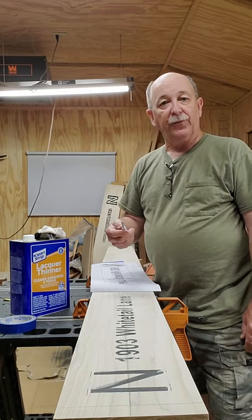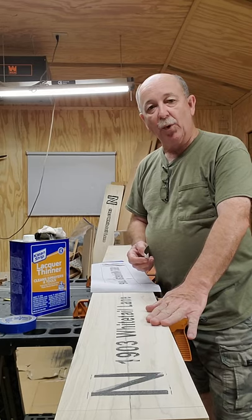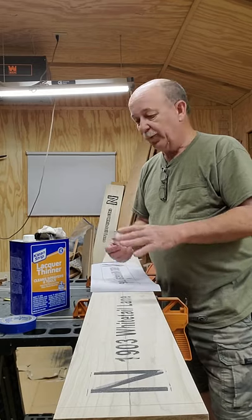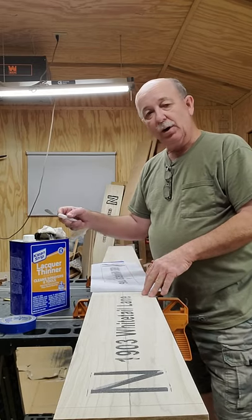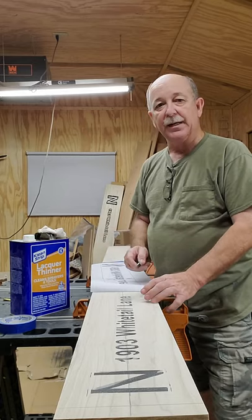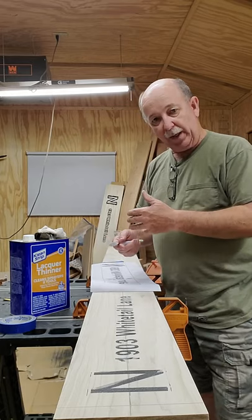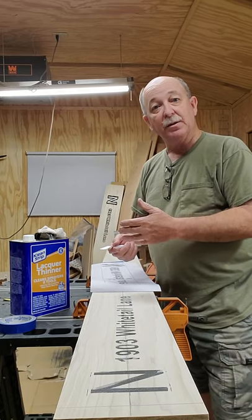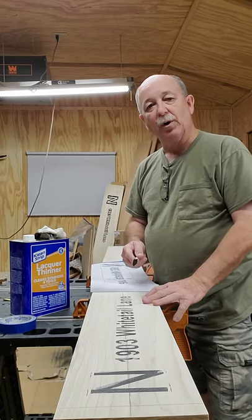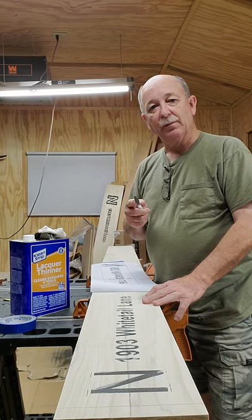I hope this helps some of you out there that are having trouble with it. Again: good finish on your board — smooth is better, I take mine up to 220. Line your stencil up, tape it down, good quality lacquer thinner, little bit on the rag, little section at a time, burnish it on, move on to the next one, burnish it on, then peel it up, take a look at it. If any of it needs to be redone, lay it back down and do it again on just the spots you need to work on. This will work for you, I promise you. Have a good day.